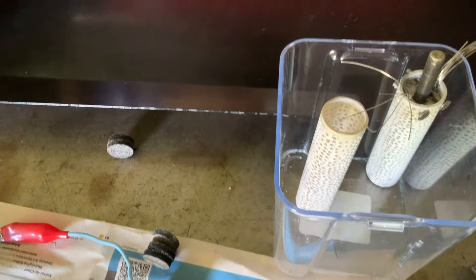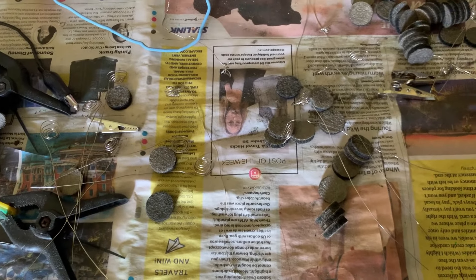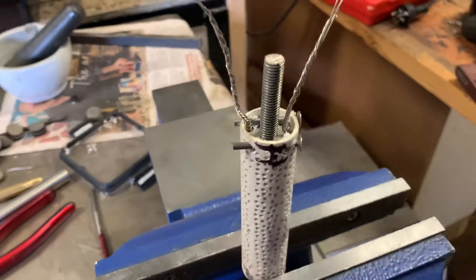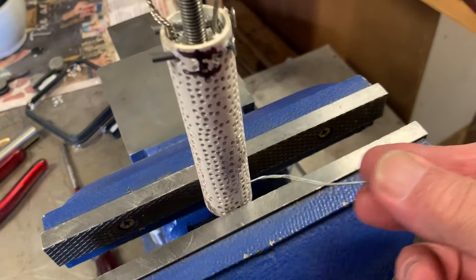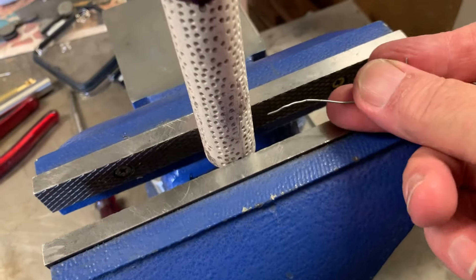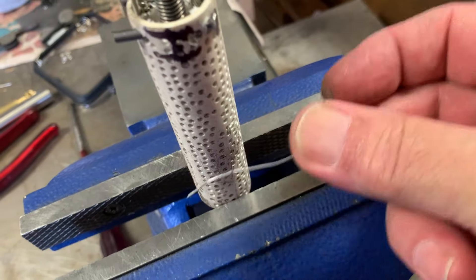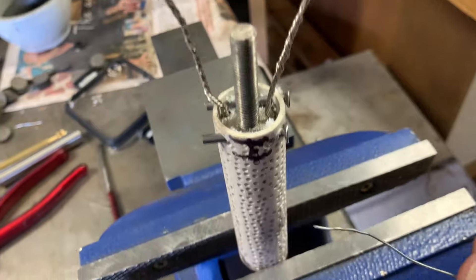So I just have to make the iron side. I'm not going to use any iron particles, just Fe3O4 layered up. The iron side's done. It turns out you can get 20 layers by compressing it with a slightly smaller bar than the diameter and putting a pin through there after every four layers. You work your way up and you can actually pack 20 of them.